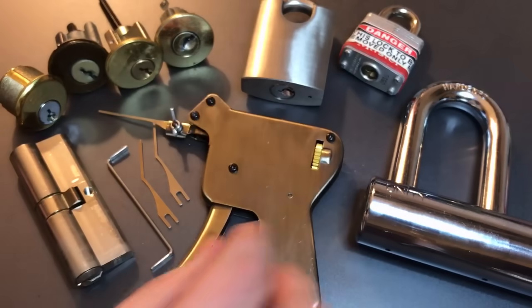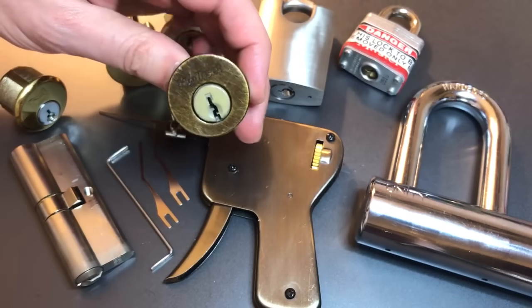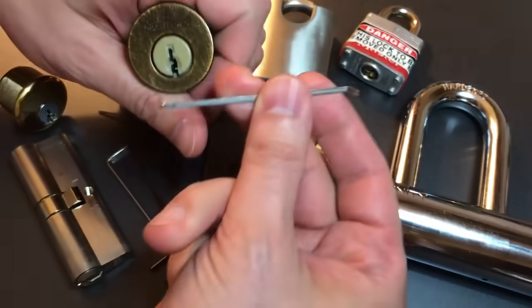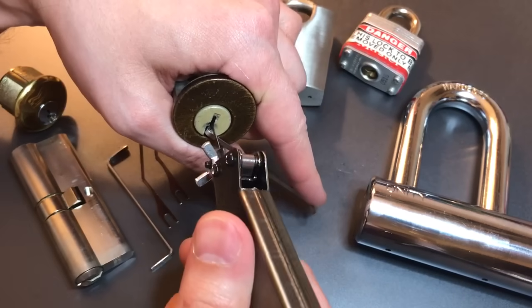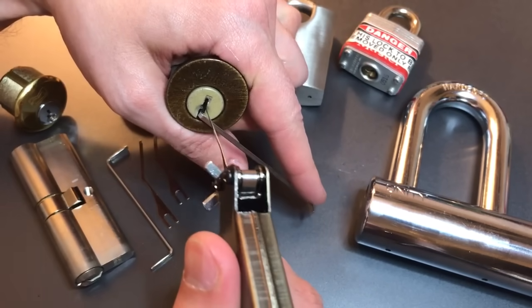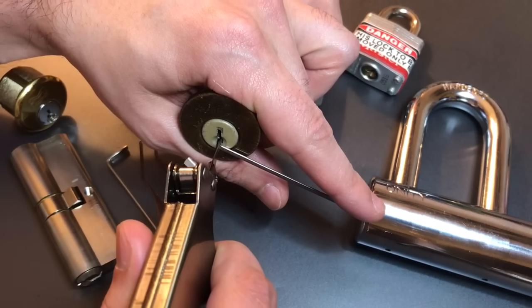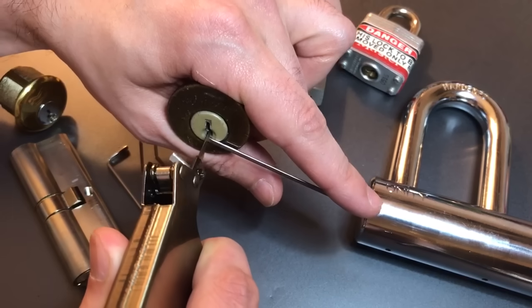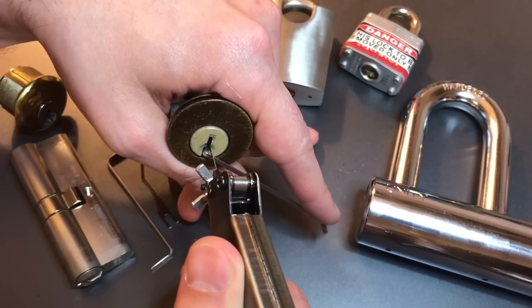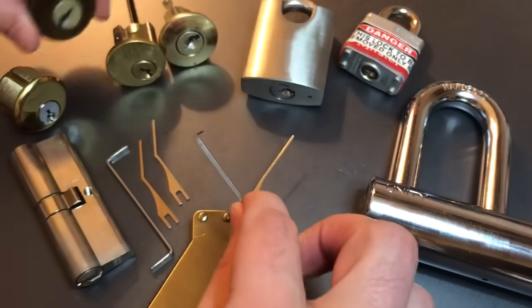Let's try to open some of these locks up and see what happens. You'll see some will open quickly, some may not open at all depending on how lucky we are right now. Let's start with a Kwikset here. I'll use a little tension wrench in the bottom and place the tip in, pull the trigger about halfway and get it so we have about that eighth inch of travel. Then do a few little snaps and hopefully we'll be able to get this open. Okay, nothing so far... there we go, got it open. As you can see, it does take a few tries.